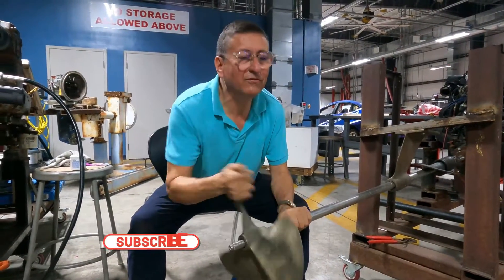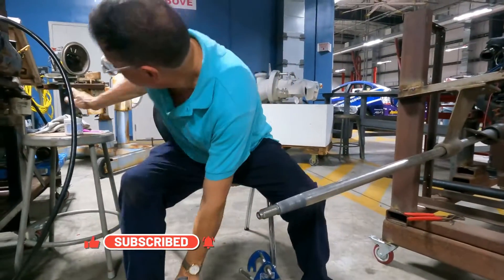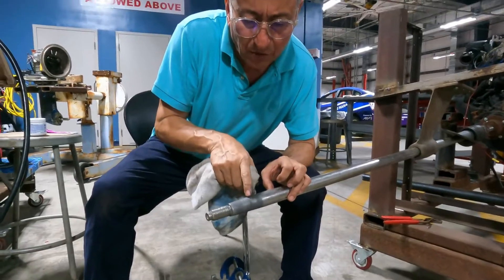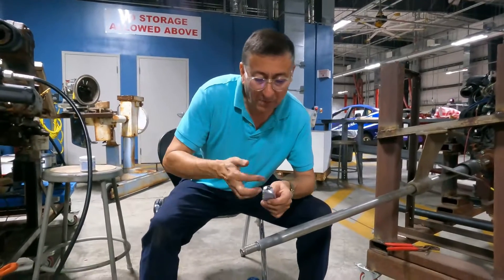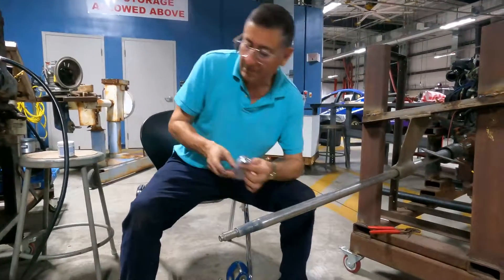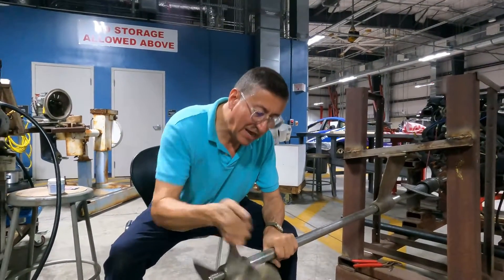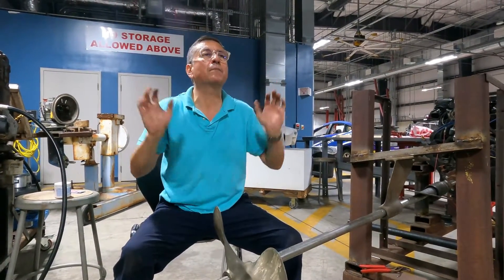It's a long process — about 15 to 20 minutes. You remove the propeller periodically, clean it with mineral spirit, clean the surface, and check: if you see a shadow here and not there, you need more lapping. Apply more lapping compound and repeat the process two, three, four times until the surface on both the propeller and the shaft is perfect, like a mirror.